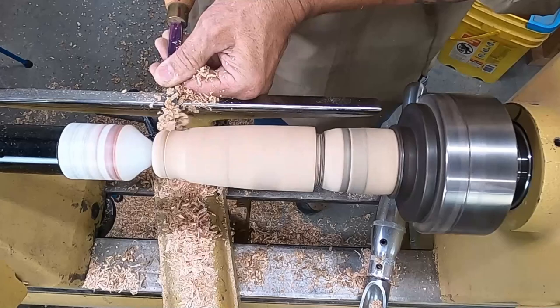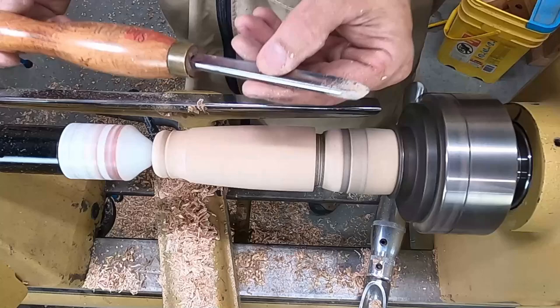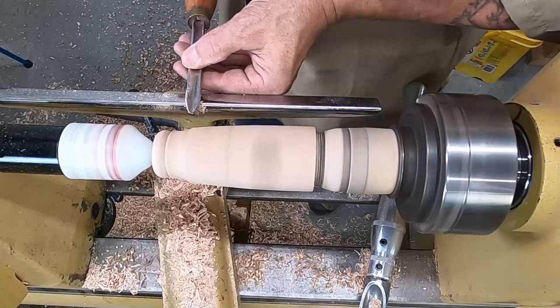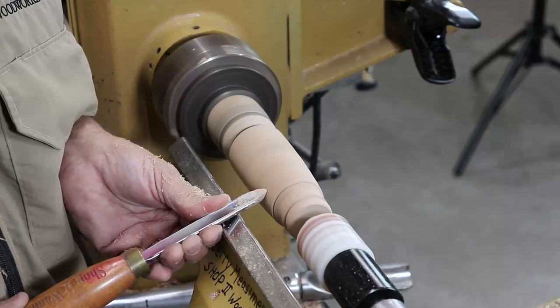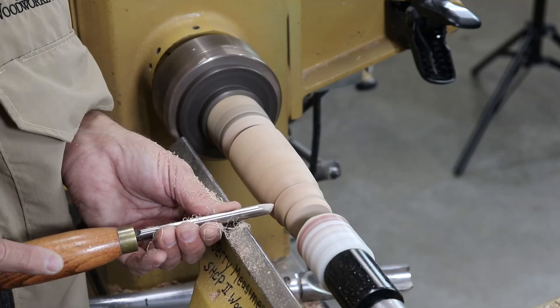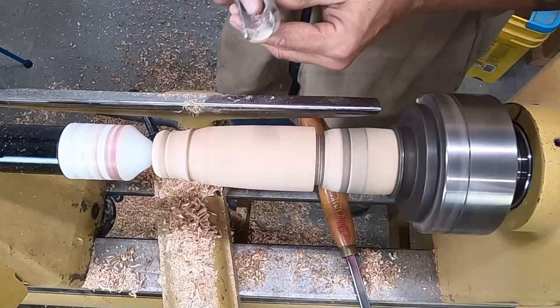We're going to make a bead right here — I just move it around a little bit. Could you make a bead with a spindle gouge? Yes. This is a half-inch spindle gouge — I've had this one a long time too and I'm ready for a new one. I come in there, clean it up a little bit, then come back on the backside — see how I just spin that around — then come back over the top. That's how I shape that bottom. Then I come back with my roughing gouge and bring all my cuts together.